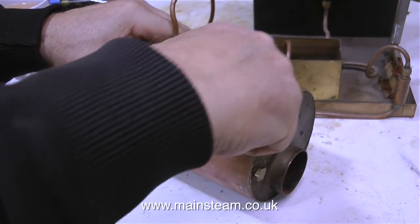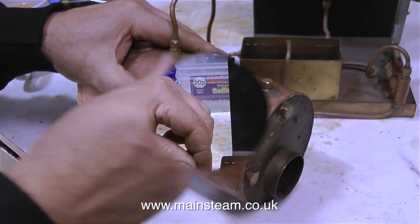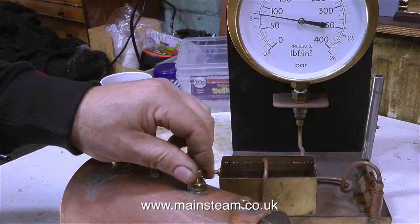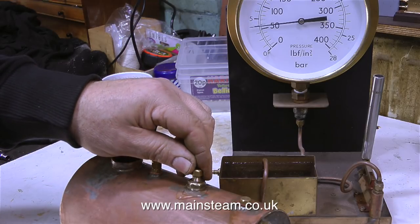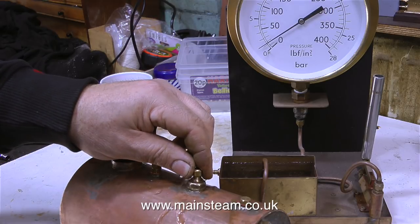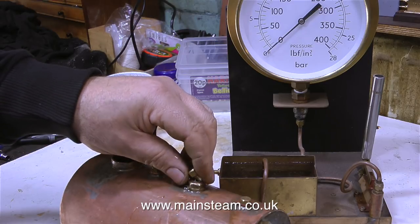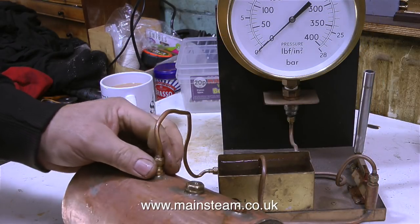After 15 minutes, I think it was a bit longer than that in this case because the phone rang, I have to remove the blanking plugs. There's no danger whatsoever in doing this because even though there's a lot of pressure in the boiler, it's only water. So I very slowly undo the plug and you can see the water starting to come out and you can see the pressure dropping. Yes, I get a lot of water squirting at me and running onto the bench, but that's really not a problem, is it? If the boiler was full of compressed air or even worse, steam, there is no way I would be doing this. So I'm pleased to say that this boiler is past fit for service,